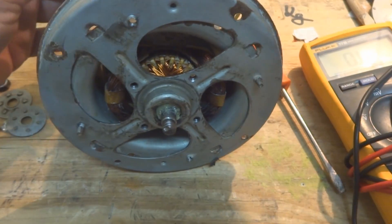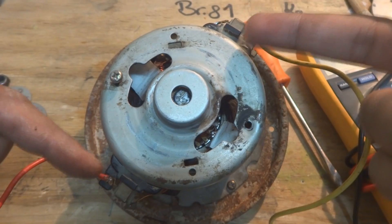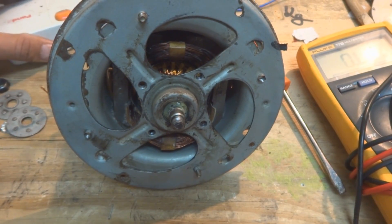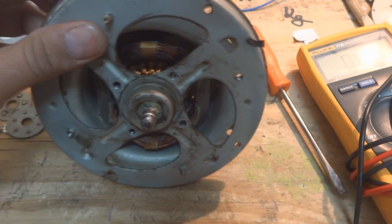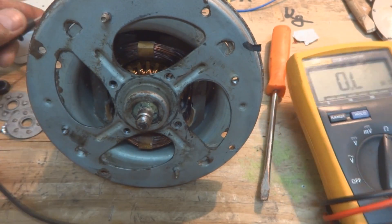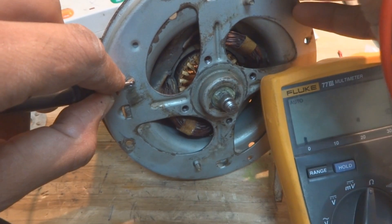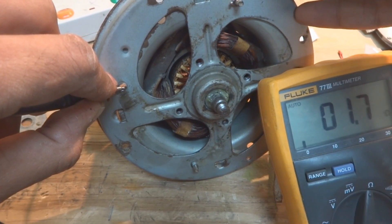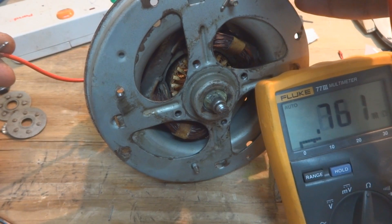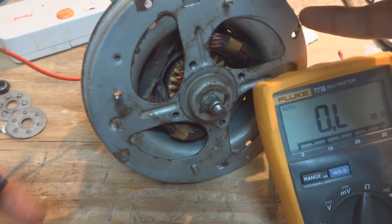You can see these two wires have come off the winding and brush assembly. Before plugging it in — for demonstration purposes — the important thing is to first test for any short to the body. The multimeter test is not fully valid, but it gives some idea. Touching both terminals gives low resistance, and touching the winding gives very high resistance — essentially the resistance of my hands. It's out of limits, so it's not shorted.